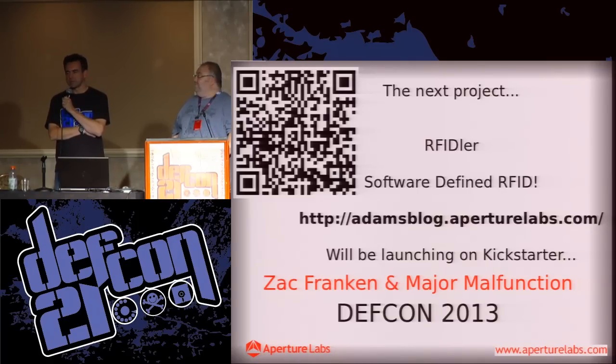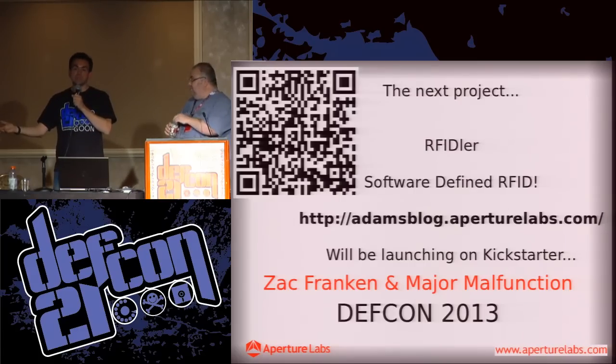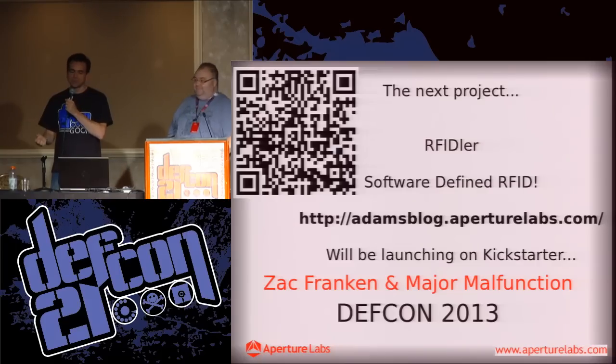On a related note, we've used the Decapinator to drill a hole, and then his very precious microprobes to selectively break wires and then probe on and actually feed our own data in instead of what was supposed to be coming from the other guy. We're all about getting this into the back room economy, so you can do this yourselves. So where would we have got the thing that sends the data into these probed devices, do you think? Not eBay, no. We got it from SparkFun, and it cost like £30, and it was called a Bus Pirate.